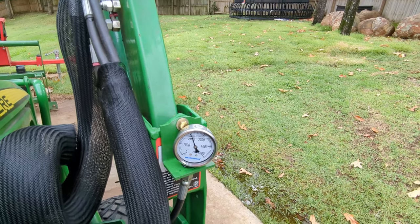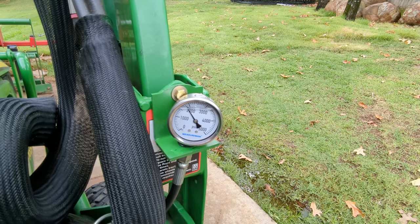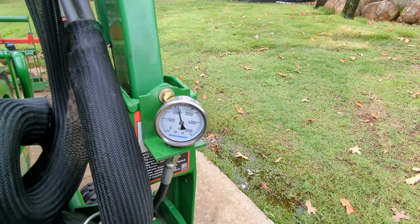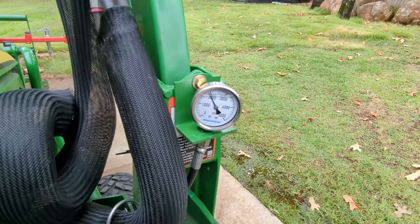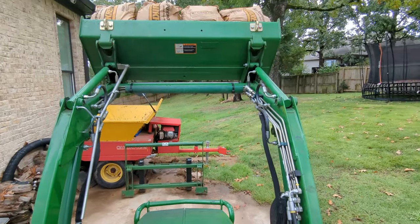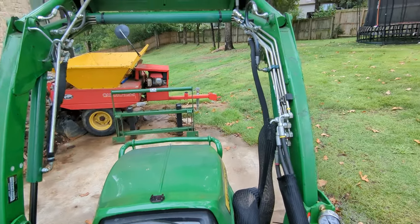I'm raising it up — I went right up against the pressure relief valve and I'm going to come back off. That's basically at the very top, and you can see we're at 1900 psi. That means with these particular 1.75-inch bore cylinders you could lift this 850-pound load up to full height — you can't do that with 1.5-inch bore cylinders, but with these you can.